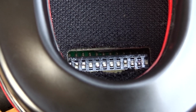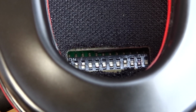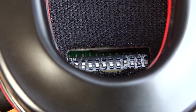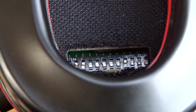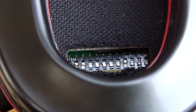So for my transmitter, and this goes through to the instructions, which I'll try and leave a link to in the description if they're available online, effectively the only switches I need to worry about for the settings I've got are dip switch 3, that one there, and dip switches 9 and 10, which are these two here. And that relates to the end of the plug. 9 and 10 should always be opposites to each other.